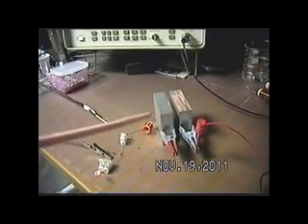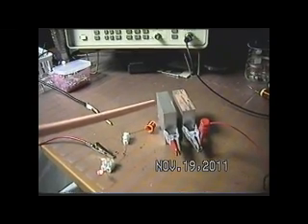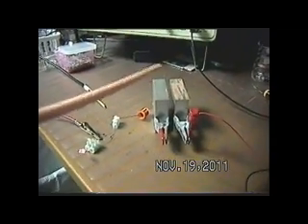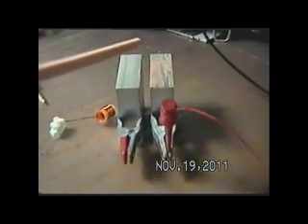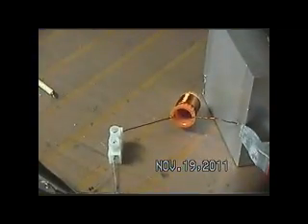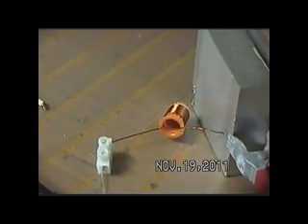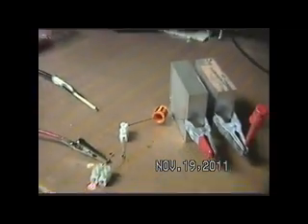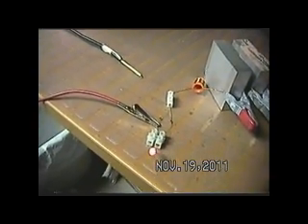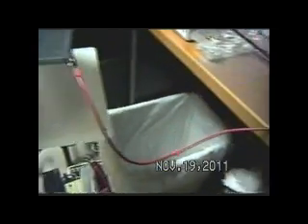The size of these blocks are 6.2 centimeters by 5.8 centimeters, and the separation in between the two of them right here is one centimeter. And here's a little coil right here which is tuned to 92 megahertz — that's the SRF of it — and here I have an AV plug with a red lead.